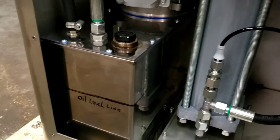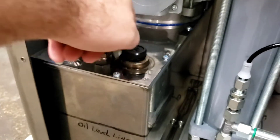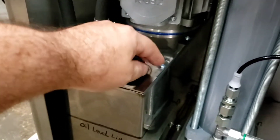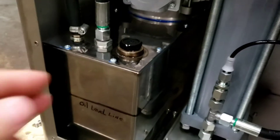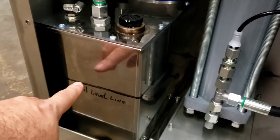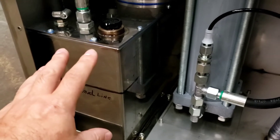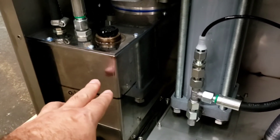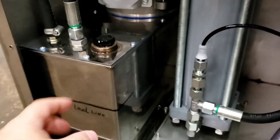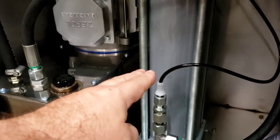Over here is the oil reservoir. You open the top in order to put more oil inside — check that every so often, maybe every six months to annually. This is the line I drew so the customer can understand the oil level. Any time you're putting oil in, you need at least three quarters full, leaving a little bit of space so that when the machine is working it has some flexibility. Also, when putting oil in, make sure the piston is in the down position.